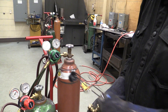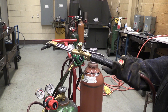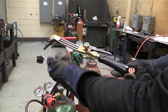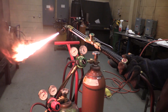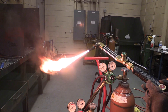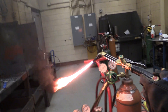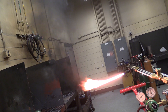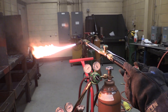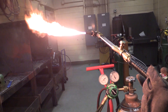To light this torch, I'm going to turn the fuel gas on about half a turn. Then I'm going to bring my sparker up and the torch will light. Now if you light this torch and you have just a little bit of gas, you can see that big thick nasty smoke — that's not enough fuel gas. So we're going to bring this fuel gas up a little bit more and a little bit more until that smoke disappears and just turns into a light gray smoke.